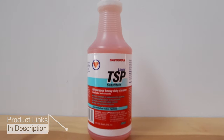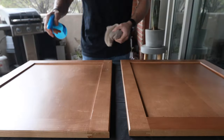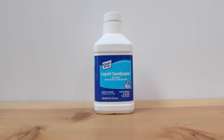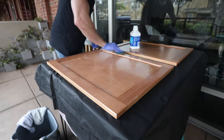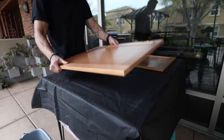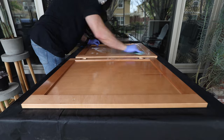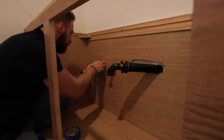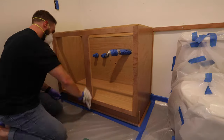The first thing you want to do is clean everything with a mixture of TSP and water. This will really help to remove any grease and dirt on the surfaces. Next, I used liquid sandpaper, which really helps to remove the glossy finish on the cabinets. You just work the product into the wood with a sponge, let it sit for a bit, and then wipe it off with a wet rag. Then I masked off the water valves and drain pipe, and used the liquid sandpaper on the face frame of the cabinet base.